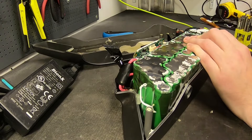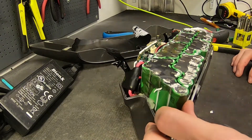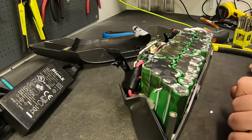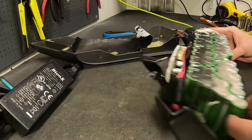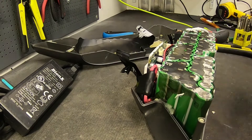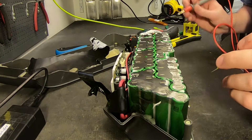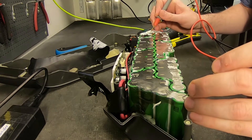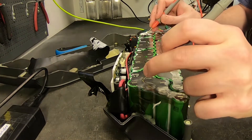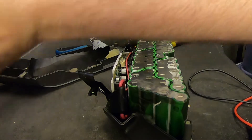What kind of voltage do we have? I actually remember seeing something quite similar — could it be that I've seen a Smart battery before? Maybe, maybe not. Probably 48 volts. Counting the groups: 1, 2, 3... 13. Yes, it's a 13s 4p lithium-ion battery with Sony cells, most likely using a BMS. I can see pins over here and pins over here, so let's give it a measure. The cells are just gone — 0.4 volts per block, 1.8 volts here. They are totally depleted.